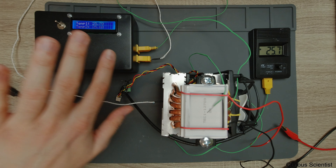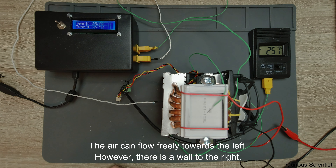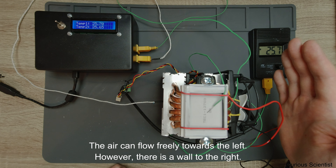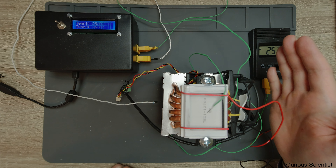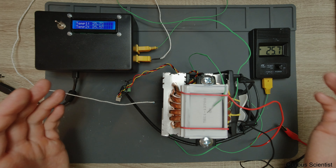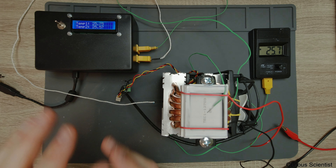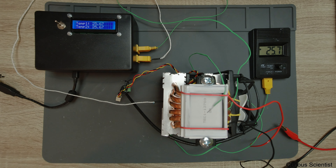This side is more free, so the air in this direction can go freely. However, there is a wall very close to the other side of the experimental setup - about half a meter. So it doesn't make sense to push the air that way because it might get trapped and end up warming up this corner of the room. The warm air will go toward this direction, which is a very large and open space.